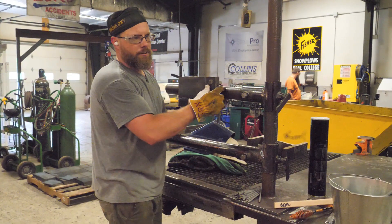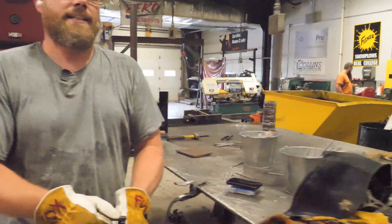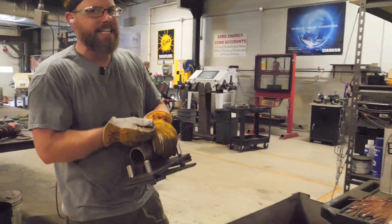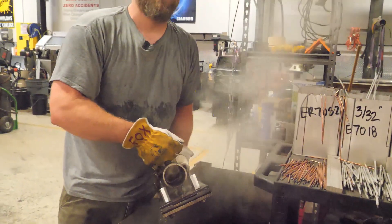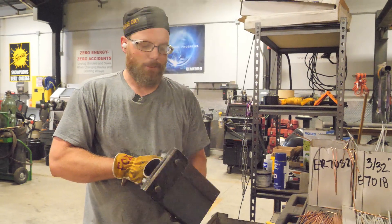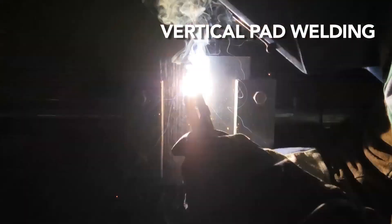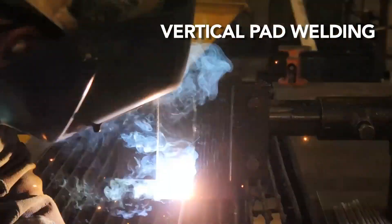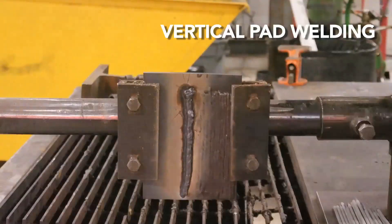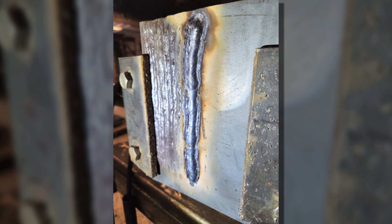We're going to switch to vertical, 3G. Before we do that, we're going to pull our plate and take it right to the quench tank to cool it down. A plate that hasn't been quenched will give your rod more heat than it needs and affect your welding. For vertical, we bump our amperages down to 110 for new welders. We recommend a 5 to 10 degree uphill push angle, because any more than this gives you a long arc situation which adds unnecessary heat into your weld puddle, causing saggy, humped-up weld beads. We also recommend a slight weaving action to flatten out your weld profiles and prevent undercut in the toes of your welds.